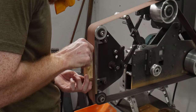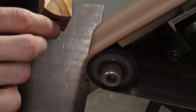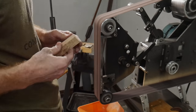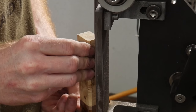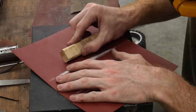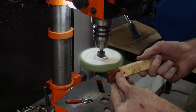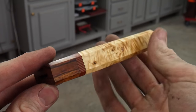Once burned in, I notch the tang to help lock it into the handle on the final glue-up. Using 1-2-3 blocks, a height gauge with a pencil clamp, and my surface plate I scribe lines on my handle parallel to my ricasso, then grind down to these lines on the flat platen. To make a pinch grip more comfortable I use a two-inch contact wheel to grind in some curvature on the front of the handle. I also marked out target grind lines on the corners to turn this square block into an octagonal handle. The beauty of the Wa handling method is that you can remove the handle from the knife to do your shaping, giving much more control and reducing chances of damaging the blade.